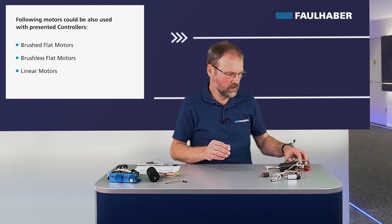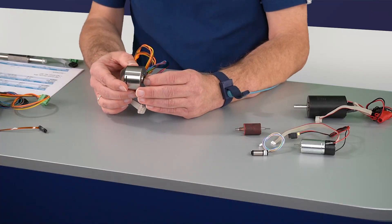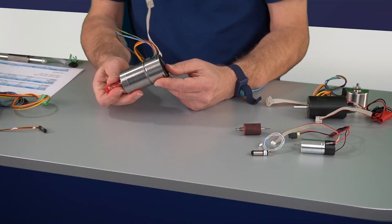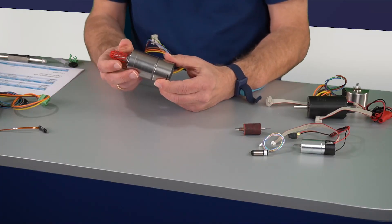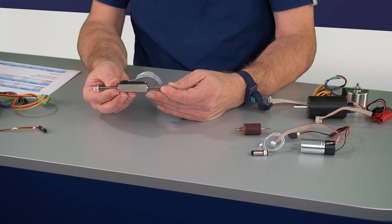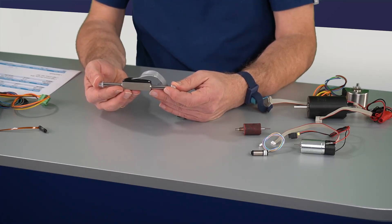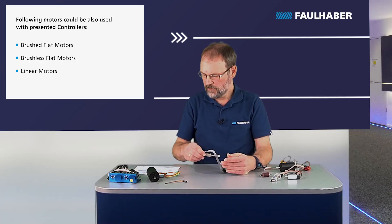And that's not all of them — we also have the flat ones, the BXT, again in three sizes, and the high-efficiency BP4 motors, and of course all the ones with gear heads too. In the end there are also the linear ones, again three sizes, with currents in a range of up to one amp continuous, and forces from one newton to nine newton. So that's the motor range — from about one watt to 300 watts continuous power — and that's where we need the drivers.